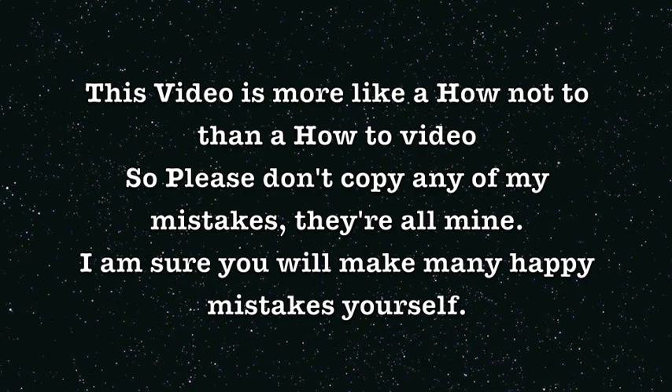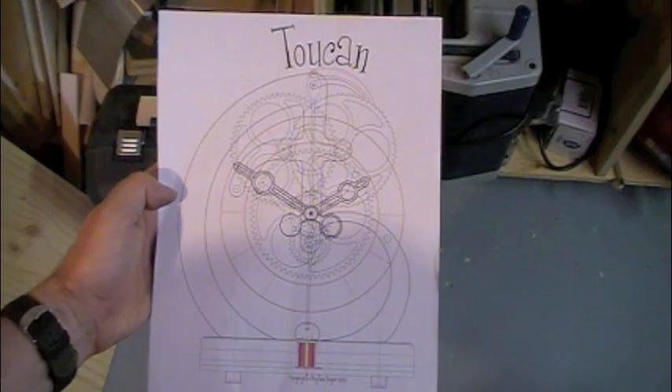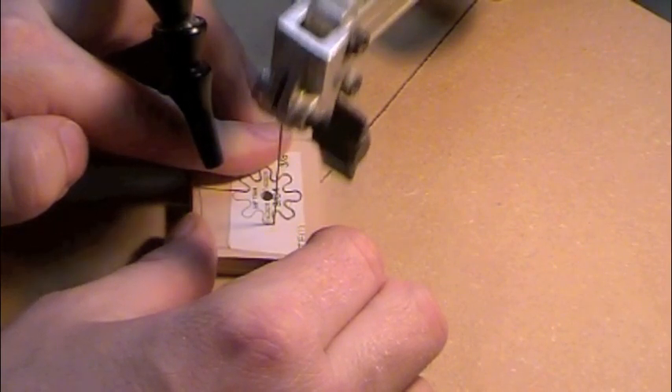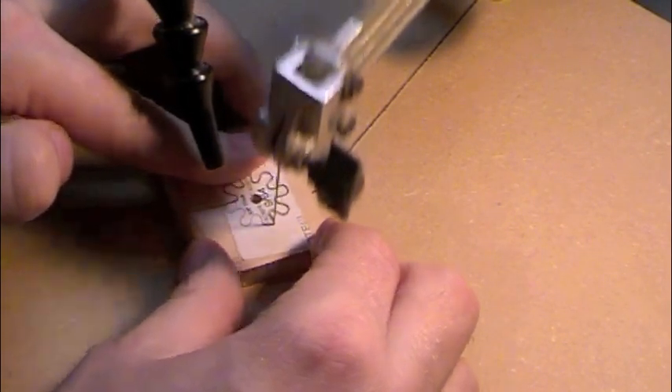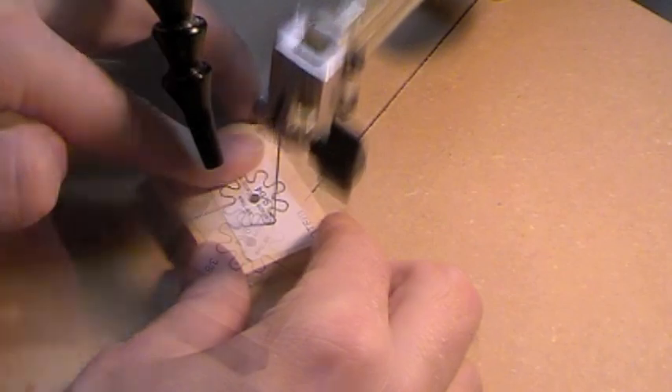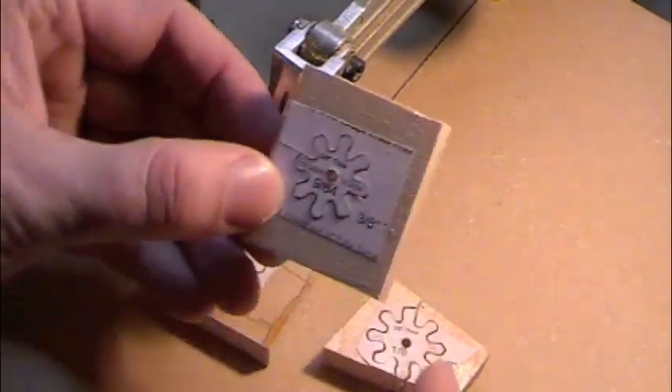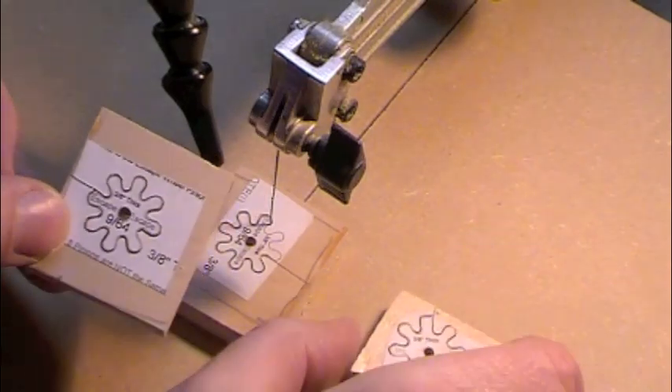The Toucan - what an amazing looking clock! I'm going to build that one, and on the way I'm going to show you what I learned. I'm using the scroll saw for most of this clock build, and if I take it nice and easy around these teeth I'll do a nice job. I noticed that if I didn't have enough wood around the pinions - at least half an inch - the scroll saw blade would actually yank the pinion out of my hand and bust the blade.